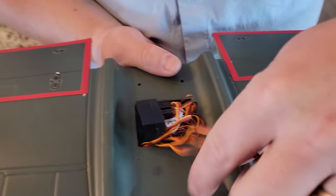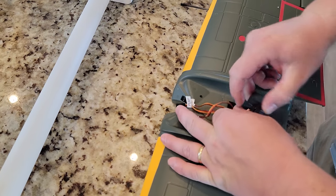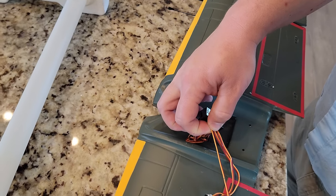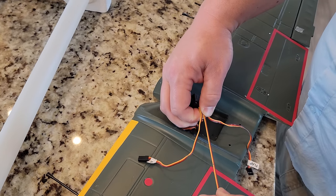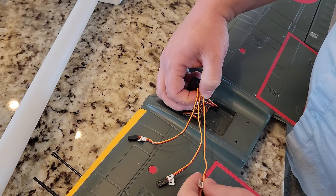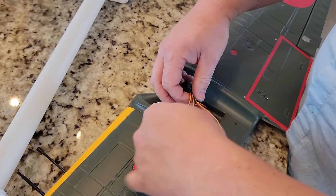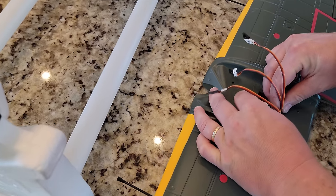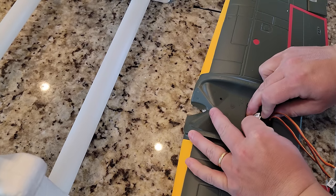I need these wires to come out a certain way — on this side of the box. That's going to give us the most potential length. I'm going to pull hard and take the memory from that big tangled ball out of there. These wires are malleable and ductile so when you pull hard they will straighten out — the memory goes away. It gets almost hot enough to burn my fingertip. Now they're nice and straight and I can turn them to the appropriate angle, pointed toward the back of the plane.